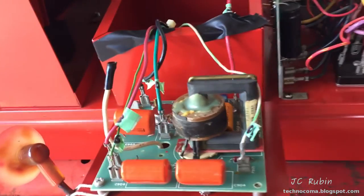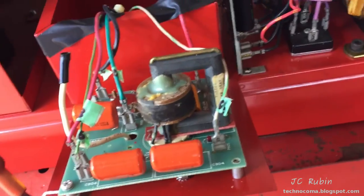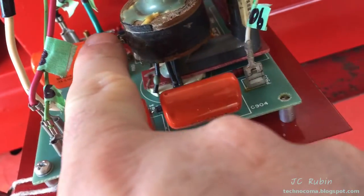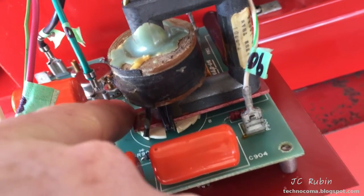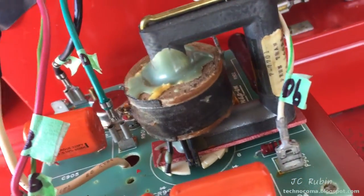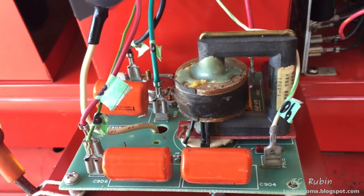We're going to do one more test. Just in case this tripler was shorted out and shorted to ground, I wanted to make sure we test this flyback transformer without the tripler connected. This wire was loose too — there was a little solder on the bottom and you can actually twist this wire in here. I clipped it off, it's now disconnected, everything's fine. I just wanted to see what happened if we remove that, so we're going to run our test one more time with the bulb and see what we got going on here.